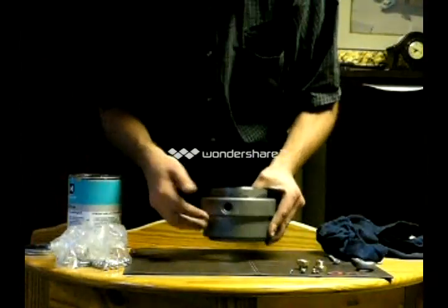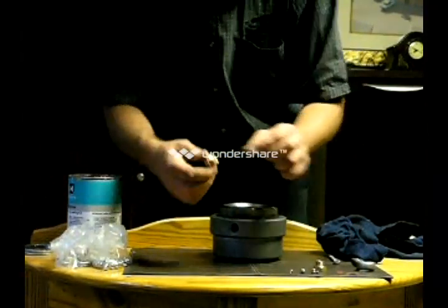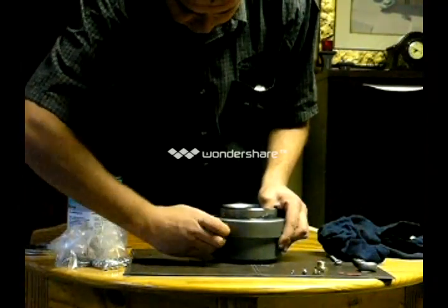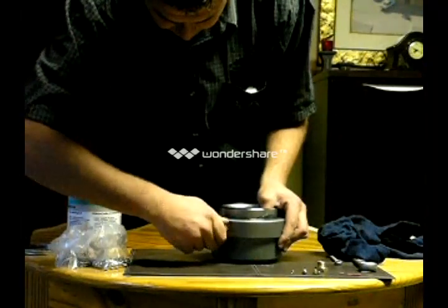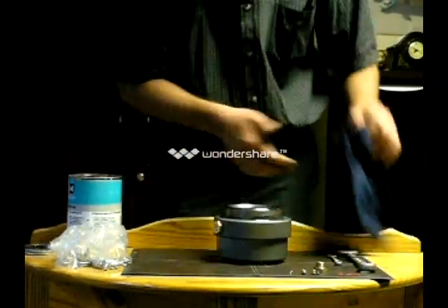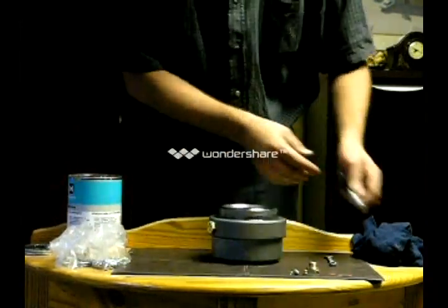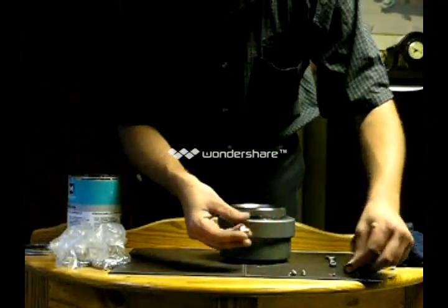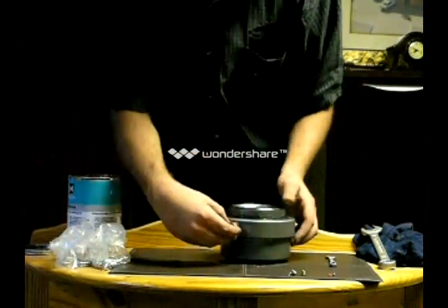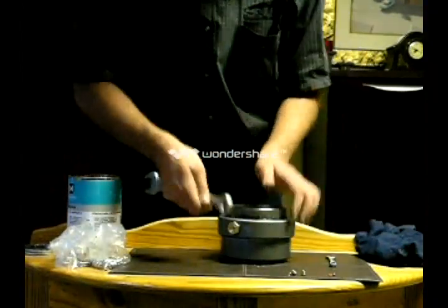After you've put all 31 roller pin balls there, you will have your two brass forward retaining plugs. Your fiber washer will go on there and that will screw into that side. Screw it in all the way to the back. Take your 22 ring spanner and just give it a little nip. Go to the other side — one fiber washer goes up to this side. Give that one a little nip as well.